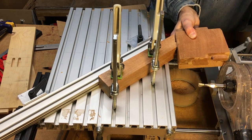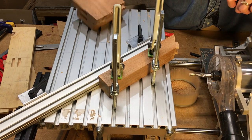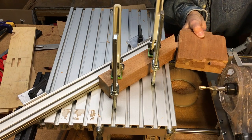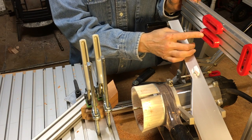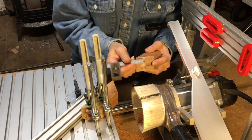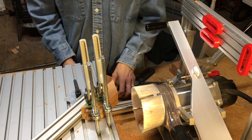It's still just a little bit too tight. That's a little bit looser than what I really wanted, so I have to adjust it — just cut it off and do it again. I've decided that I can go ahead and use one and a half inch templates rather than the one inch template. The one inch produced a tenon that was seven eighths of an inch rather than one. Using a different router bit would give me a full one inch, so that's just kind of an estimate.